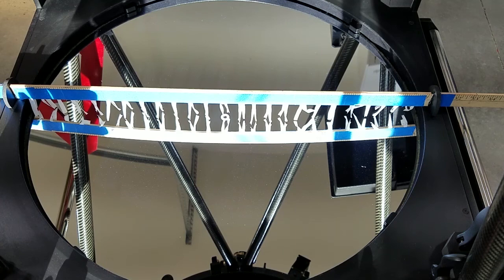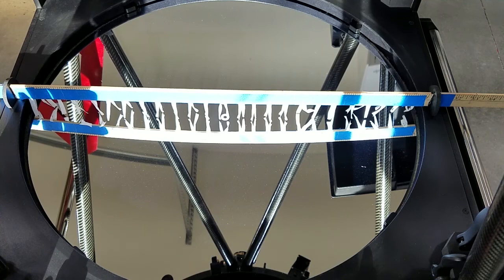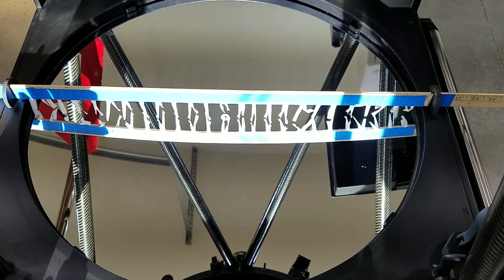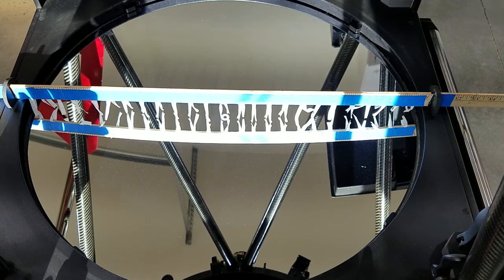This radial and symmetrical concept was specifically conceived to minimize astigmatism from uneven cooling that can arise from various sources, including combating uneven cooling from cross breezes. Although the front and back are both radially cooled, the front is very different. The back has turbulent flows with velocity roughly equalized by design — we can do this because we can build structures behind the mirror.